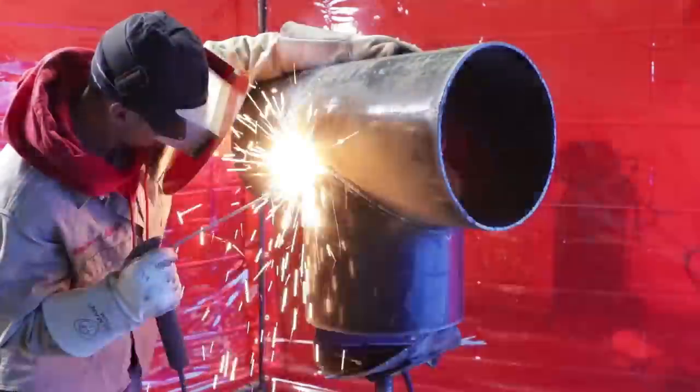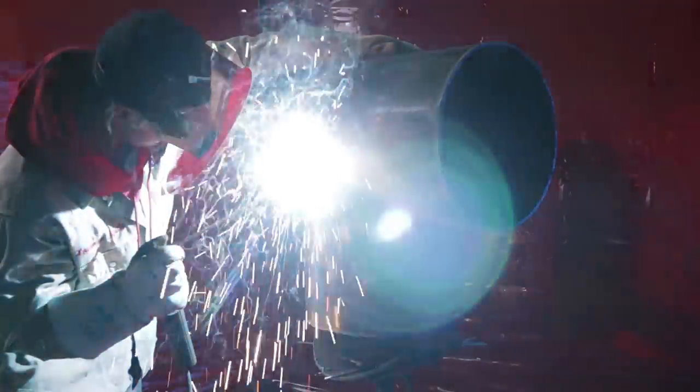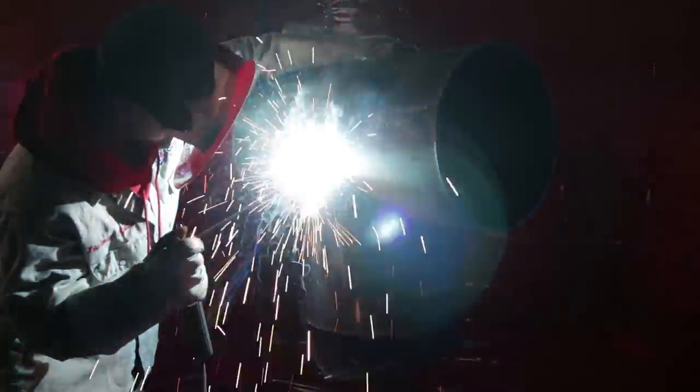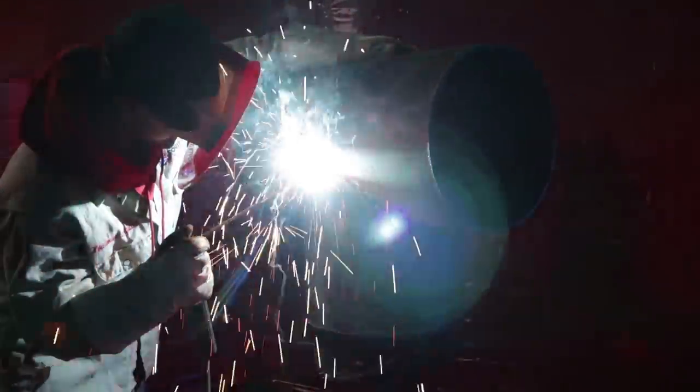And when you're doing that bottom fill like we're doing right now, do not exceed over that bevel, okay? You want to keep a guide for yourself when you start that cap, okay? But it's the same way all the way through, guys, all right? Even on the opposite side. Now my body positioning, that's the way I like to run the branch. Like I said, if you want to use two hands, whatever you feel comfortable. But even on the opposite side, it's still the same exact method. Keep that guide for yourself for the cap.